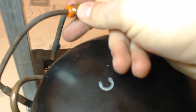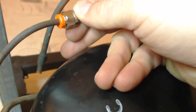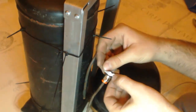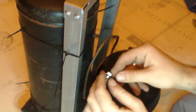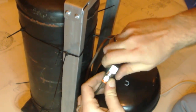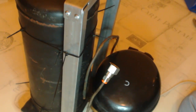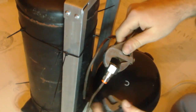For the air compressor we choose to use a freezer motor, and we choose it mainly for one reason. It is silent. We can either buy one or use one from your old refrigerator. Again, be aware of how to degas it. In this video I mainly want to show you all the stages to give the main idea, and not to tell you what exact fittings I used. So we attach the air compressor to the base and we begin with the first piece.